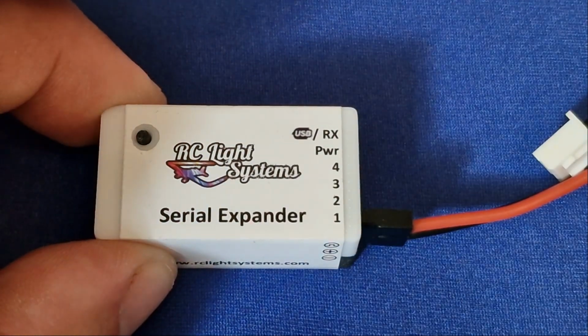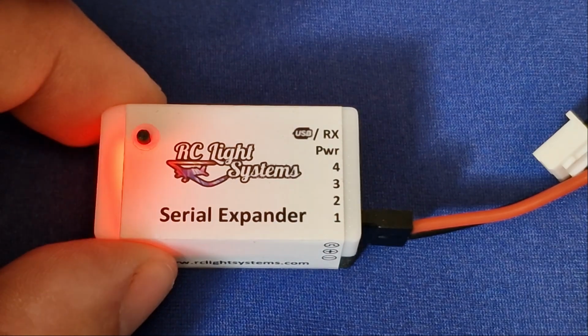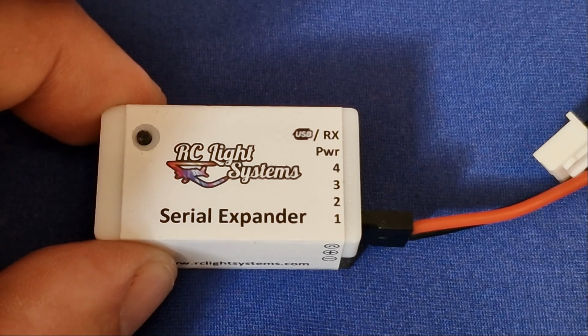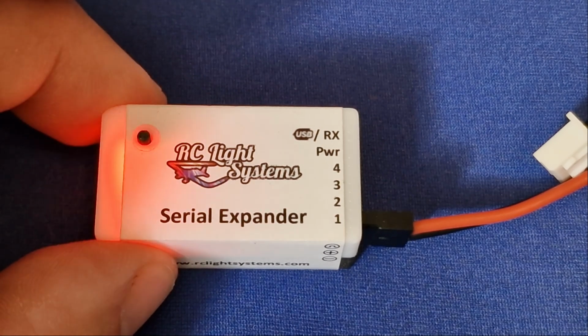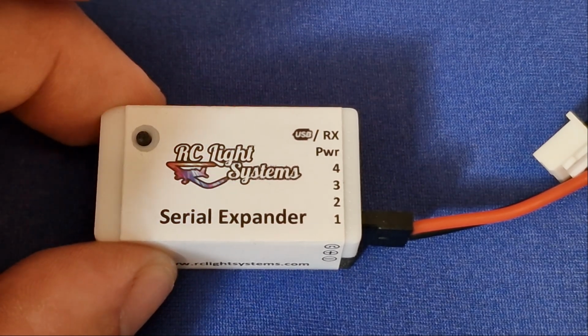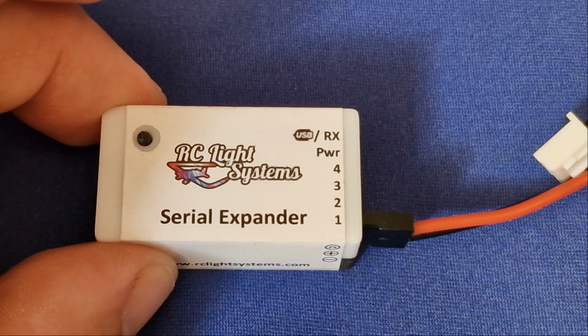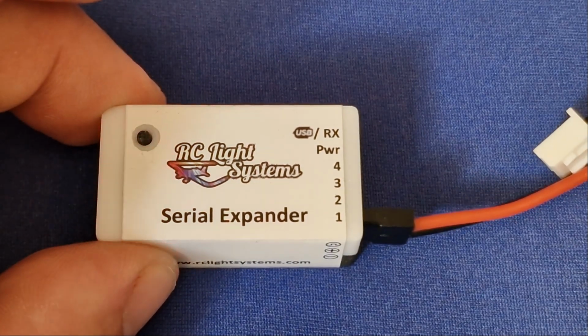This is the basics that we need to do to get it connected to the transmitter. The fastest way to configure the outputs from here is to use the assisted config, and we'll come with that shortly. But you can also use the button, and the menu items 2, 3, 4 and 5 let you set outputs 1, 2, 3 and 4 by directly entering the number.